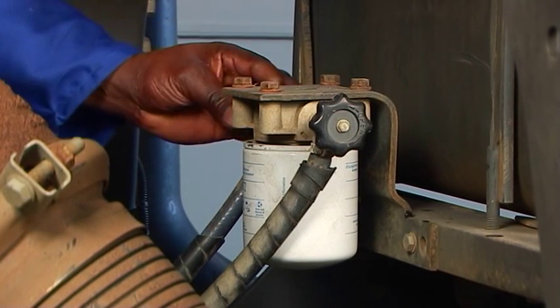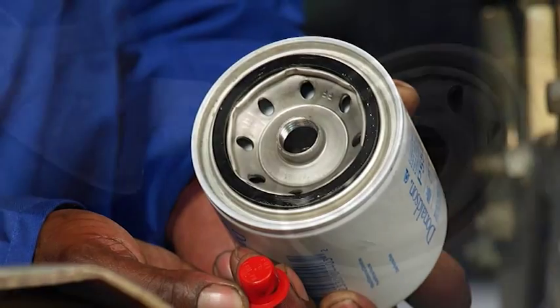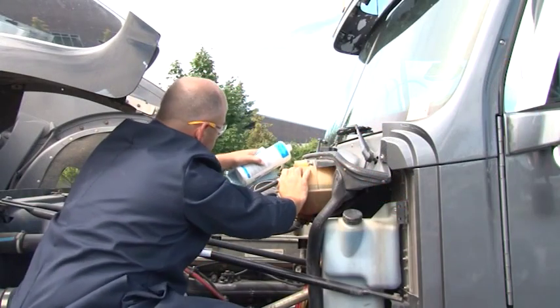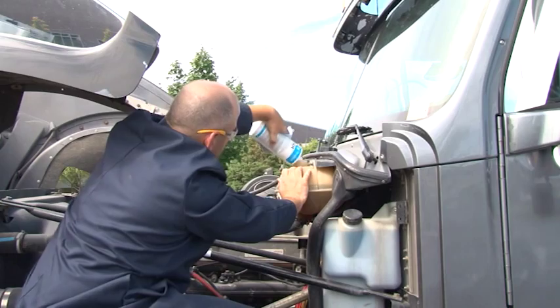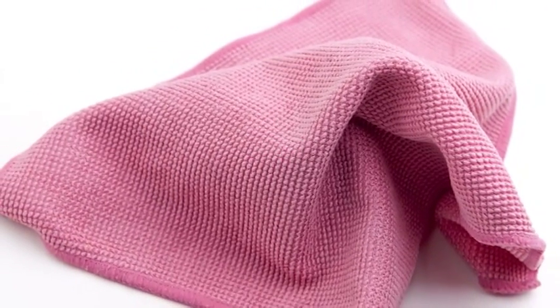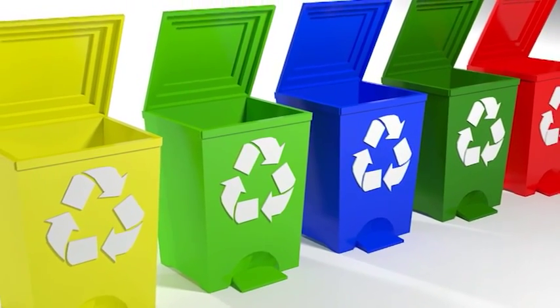Let's discuss maintenance of the coolant system. When a cooling system is serviced, coolant filters are replaced dry — they are not pre-filled with any fluids. After coolant filter installation, the coolant fluid mixture is poured into the radiator overflow reservoir. When performing a filter change, it is best to use a clean cloth during the servicing process. Be sure to dispose of used filters properly.